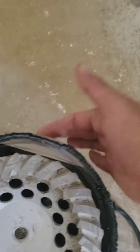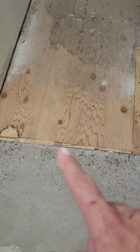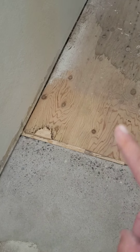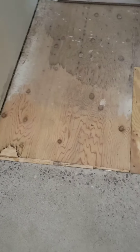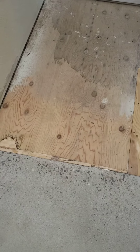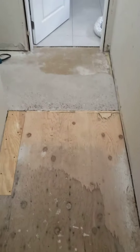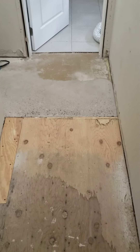This also came from the orange store and worked remarkably well. The little cover pops out to get you right up to the edge. We took it down pretty close to three-sixteenths of an inch right here, and the difference is just unreal. This was always an obvious problem — you always sensed it with the tile that was here. Now you can just walk right across it and feel nothing.